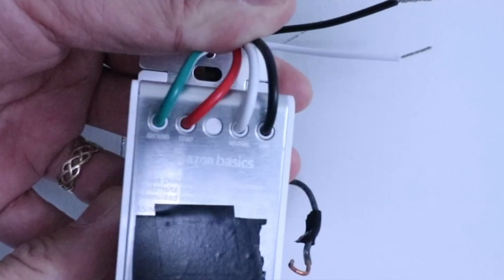Now, it's important to know if you want to install this that it does require a neutral wire. And a neutral wire is commonly available in most homes that were built after 1980 or rewired after 1980. We also have a video that explains to you what a neutral wire is and how to identify one, so go ahead and check that out in the description below as well.